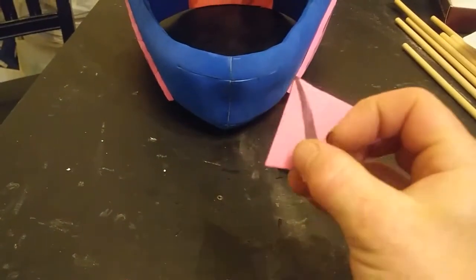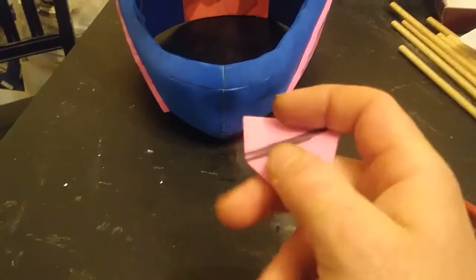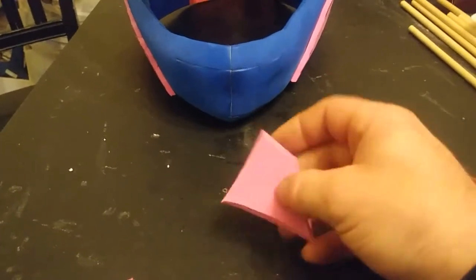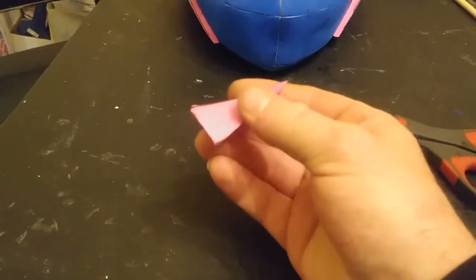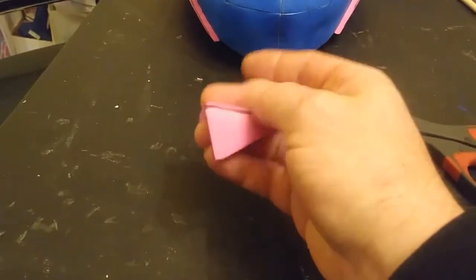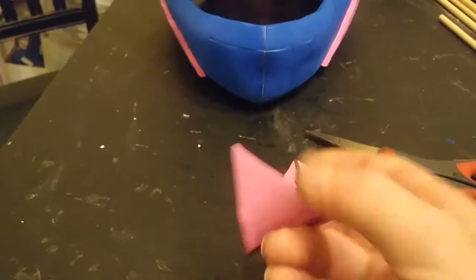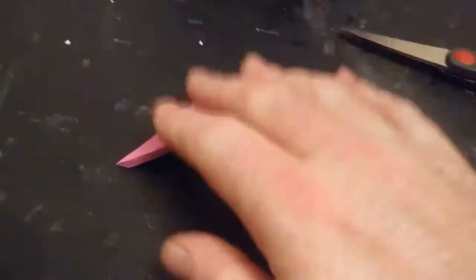Now you notice this black line down the center I just drew there as a guide. I will also put it on the pattern. It is not a cut line. It is a fold line. And what I do is I heat this up with the heat gun real good, and I've already done one here. I fold it along this line. I also stretched it a little so it has a slight swoop to it here, as you can see looking at it sideways. And there you can see side by side the flattened one and the folded one,